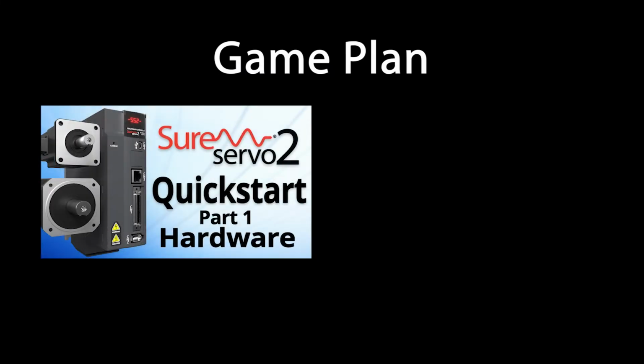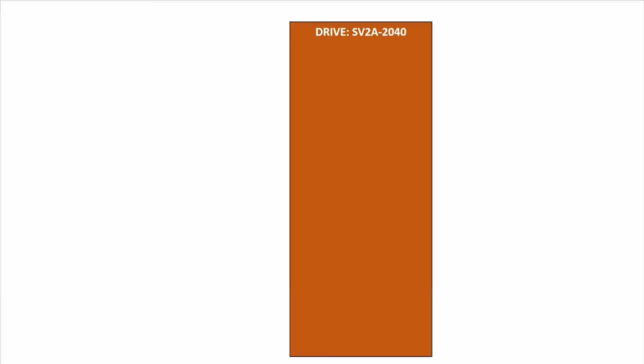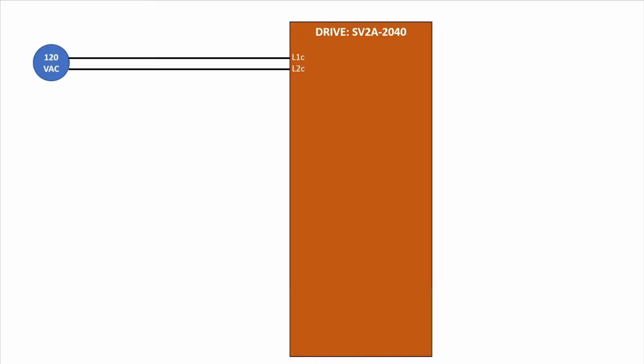In this video, we'll wire everything together, and in the next video, we'll fire it up, check everything out, and then jog the motor. Here we go. I'm using this servo drive, and I'm using single-phase 120 volt AC.